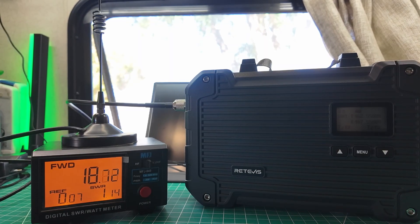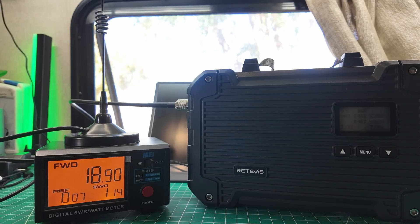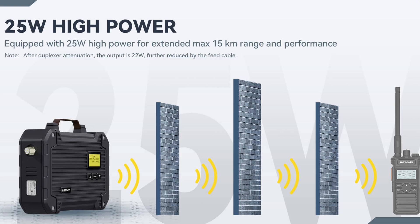WRNY966 testing. We got almost 19 watts out and 1.14:1 SWR. 19 on the peak — love it. So it's rated at 25 watts on the website. Why am I only seeing 19 watts? My SWR wasn't 1:1, so there's that. We've got coax losses, and going through the duplexer inside the box attenuates the signal a bit. So 25 watts from the radio transmitter through all of that to my meter and dummy load is 19 watts. Am I making excuses for them? Not really — some of that's true. That was at 15 volts.